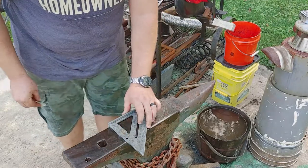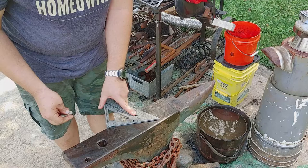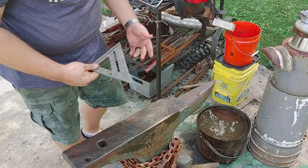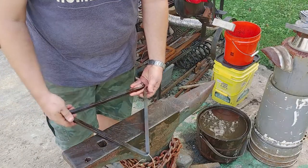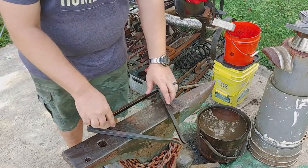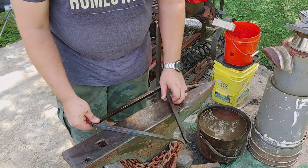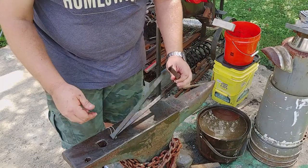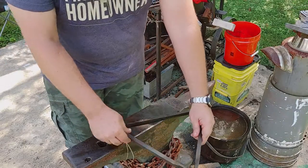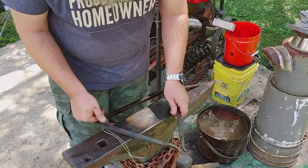I drew a line across the anvil that way, then I took it to 60 degrees. Another line, and it has the angle that I need for the triangle, because all the sides of the triangle should be close to the same size. And then I ended up putting the bar down into my Hardy to get the bend started, and then I would lay it down, and then I just come up holding it this way, and I'd hit it with my hammer here if I needed to bend it a little more until it matched that angle of the 60 degrees that I had drawn onto my anvil.